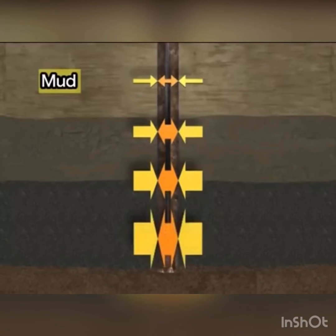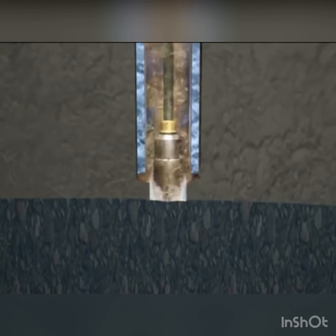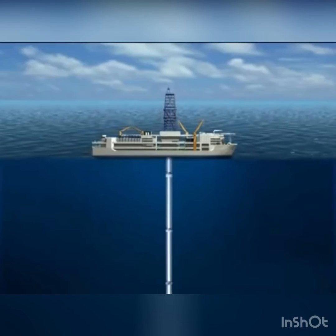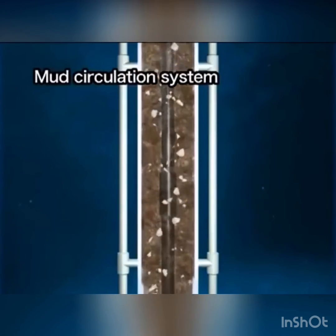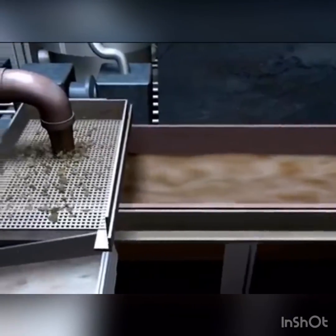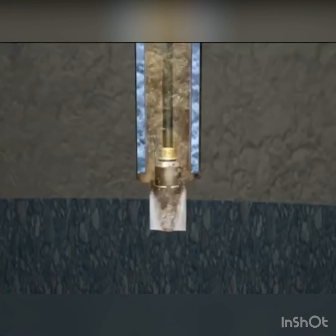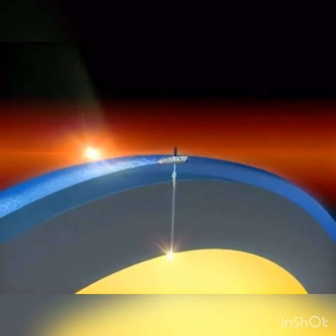The drilling mud is artificially conditioned with various kinds of products, and it is expensive. Discharging it on the seafloor is bad both environmentally and economically, so the mud is collected and reused. For this purpose, the riser pipe is connected all the way from the vessel to the seafloor. The drilling mud sprayed out of the drill bit returns to the vessel through the riser pipe together with the cuttings, and is collected and recycled at the vessel. Riser drilling not only makes it possible to drill deep into the earth, it is a breakthrough drilling method that is both environmentally and economically sound. Riser drilling will make it possible to drill all the way down into the earth's mantle, a depth never before reached in all of history.